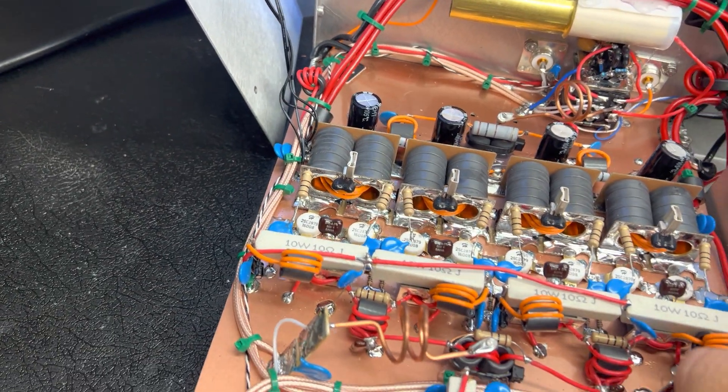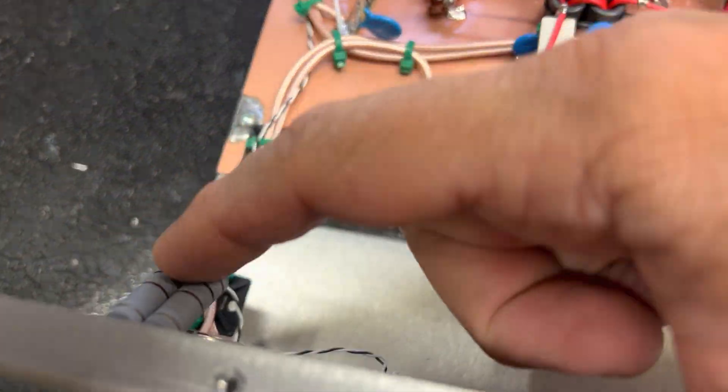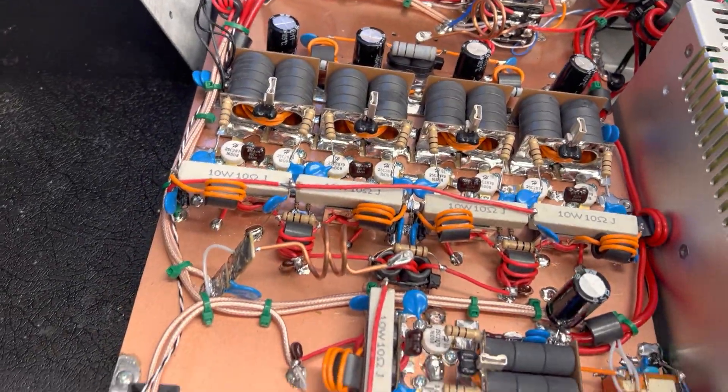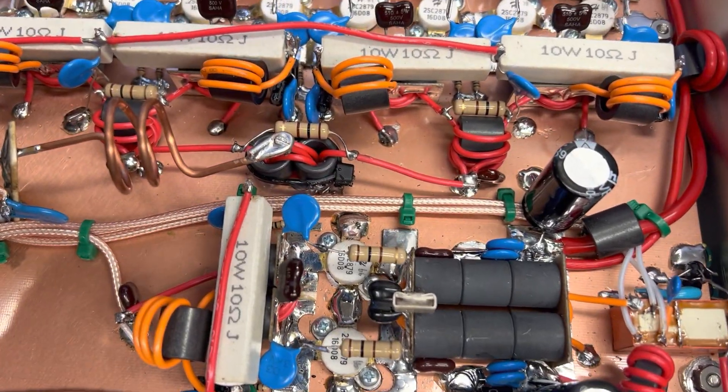It's doing a little bit more than I wanted — it's dangerously doing too much. So I put a little input pad on the two-pill section. The two-pill section was doing like 500W, and we can't have that. It makes me think about putting 2290s in the drivers from here on out to drop the power back some.